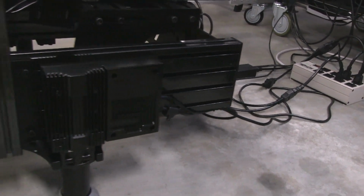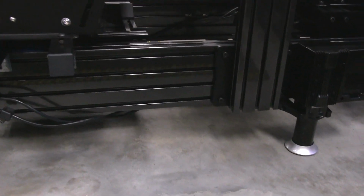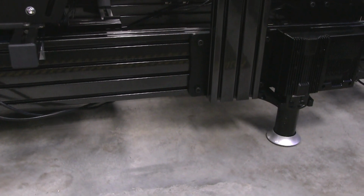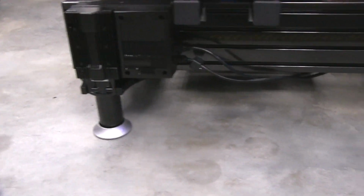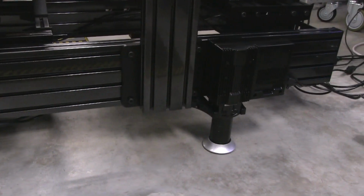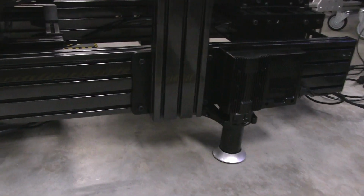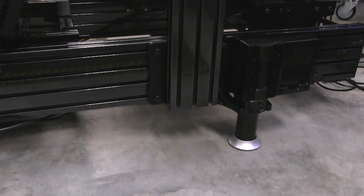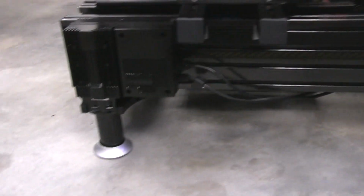I could have put this actuator all the way up at the front over there, but that would minimize the amount of pitch axis I was feeling. The actuators don't move anymore, but you feel more pitch with less space between the front and rear ones because we're moving the fulcrum closer to the other one. It's hard to describe unless you're actually in one and know what I'm talking about. It does make a difference. Again, they don't move any further, but because we're not way out in the front there with it, it just gives us a little bit more pitch axis. And with 1.5 inches of travel, it doesn't hurt.